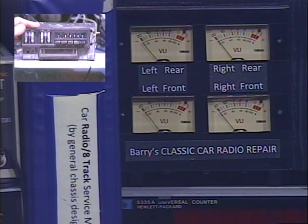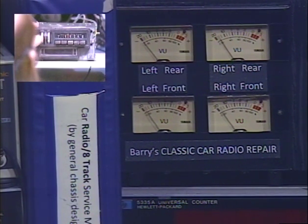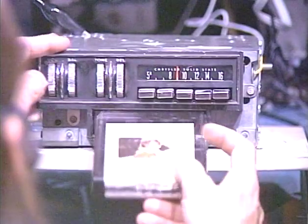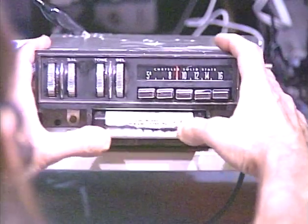Okay, we've demonstrated that. Now we're going to pop the tape in and make sure the tape works. I'm going to turn the tone control down a little bit because I've put quite a bit of brightness into this tape section. I do replace the original preamp with my own hand-built preamp, which is designed to bring out more treble from these old tapes. So we'll just pop some Ann Murray in here and see how Ann's doing tonight.